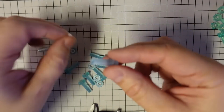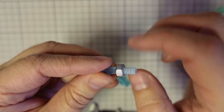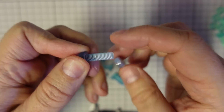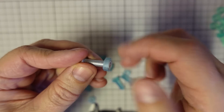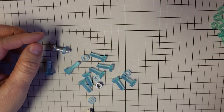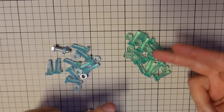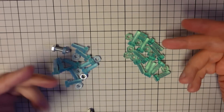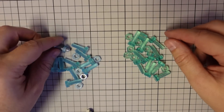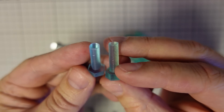Now the metallic nut goes on without any problem, though it's a little bit tight on one part. The same applies to the screw nuts. I asked the company about this situation and they told me they reprinted on the Photon S. Interestingly, the color is a little more greenish compared to the blue version, but dimensions are exactly the same — same oversize. They told me I should compensate in the STL file, but I decided to just use a tap and die tool since for mechanical tests it's not so important.